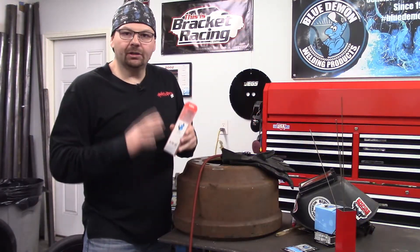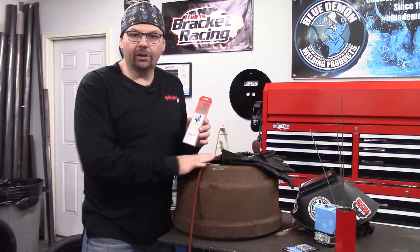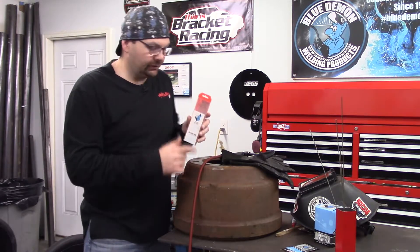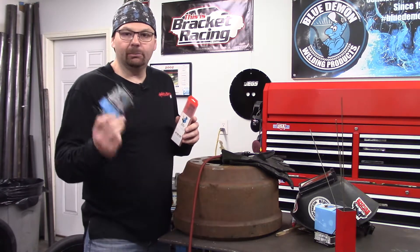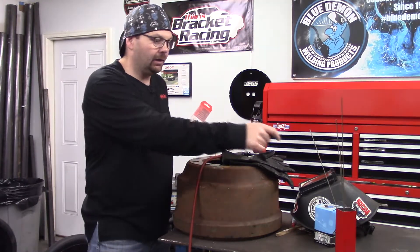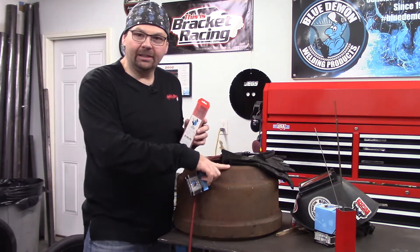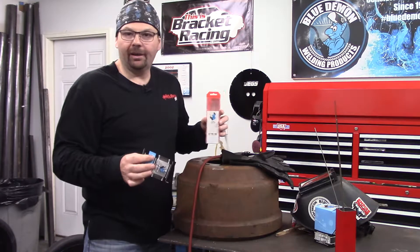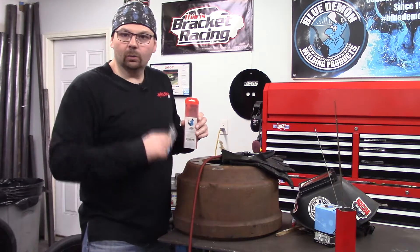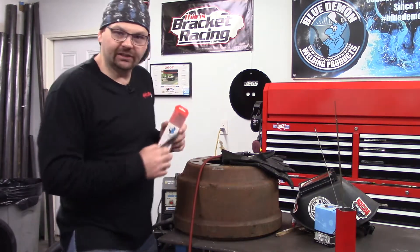Before we get started with the demonstration, I just wanted to let you know what I'm using. I've got the welder set to around 100 amps. I have 3/32-inch 2% thoriated tungstens, and I'm going to be using a Blue Demon Ace wipe to wipe down my tungsten, wipe down the weld area, and wipe down some of the filler metal. We've got enough to worry about trying to keep this cast from cracking — we don't want to have to worry about dirty items or a dirty weld area. So we're going to clean everything up and then throw some heat into this and start the welding.